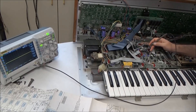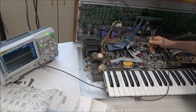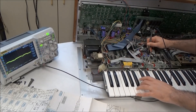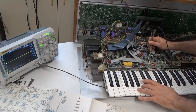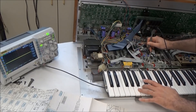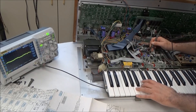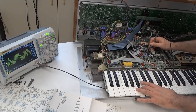So we're going to look at this CEM3360 chip. The first stage input is pin six — it's a lower level signal than before, but we can see our audio signal is still there. The output is on pin two, and our signal is still there. The next stage comes in on pin nine and comes out on pin 13 — we're not losing our signal here. The Curtis chip seems to be okay.